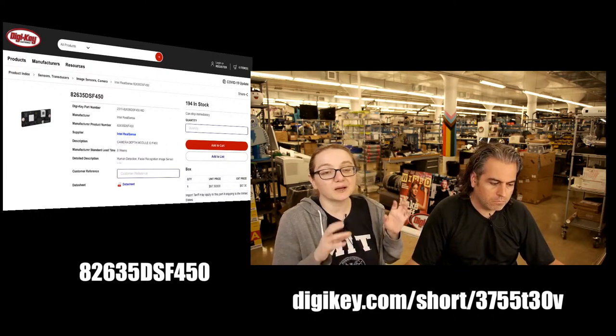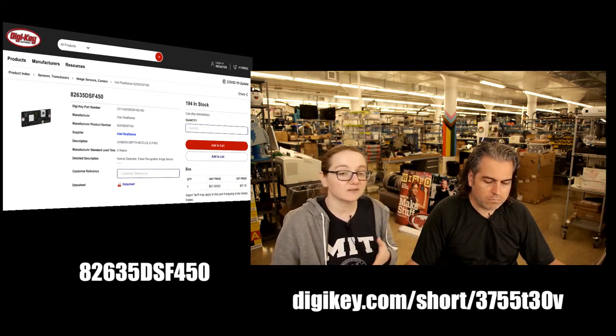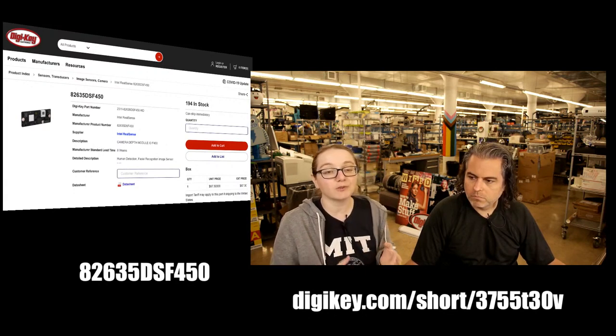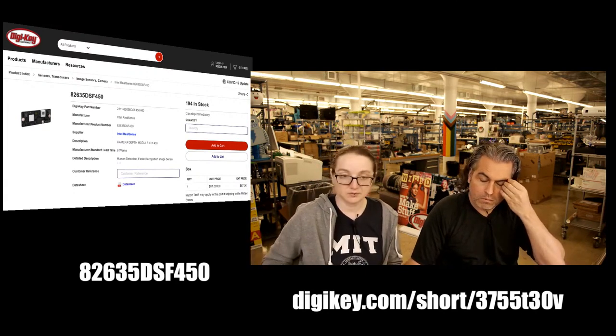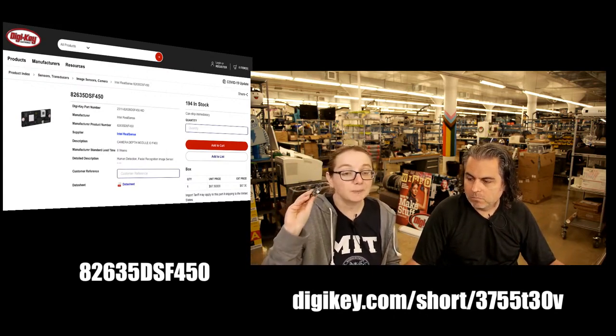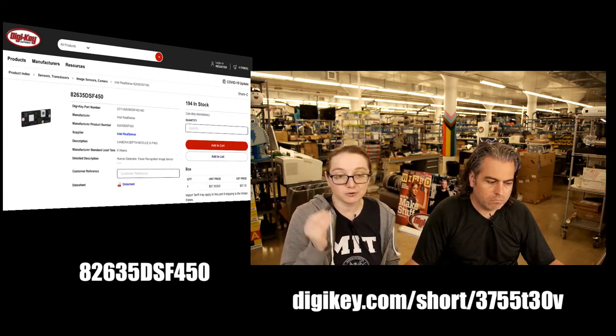What's nice is that you can get the data over UART, so the rest of your system, if it's a security system or a lock or authentication, whatever, doesn't have to be that complicated, because all the really heavy-duty computational work is outsourced to this module. You can run this with an Arduino. This could be plugged into an Arduino if you wanted. An 8-bit microcontroller could communicate with this because it's all over UART.